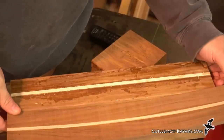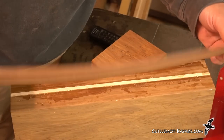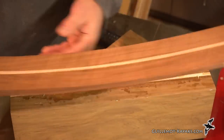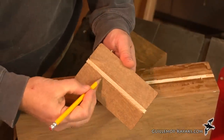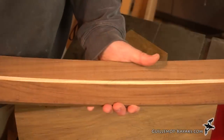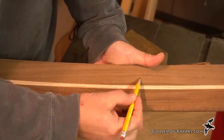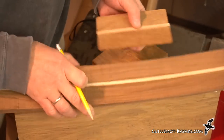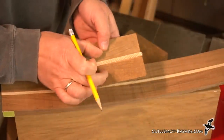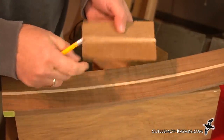These are pre-curved blades. This happens to be a 19-inch long blade, and that's the kind of blade I want to cut out of it — wide at one end, narrow at the other end, and pre-curved. If you look at the offcut here, I laid out the grain so it is kind of a bookmatch. You can just make out on the grain here that it comes out, then comes back in. I want to have the curve of this come and be sort of the grain at the wide point in the middle and the narrow point at the end.